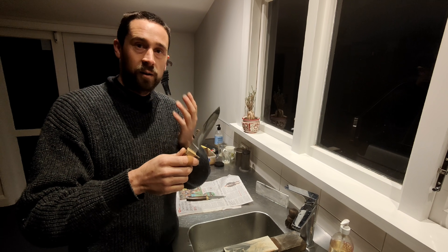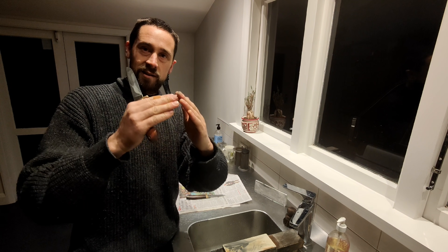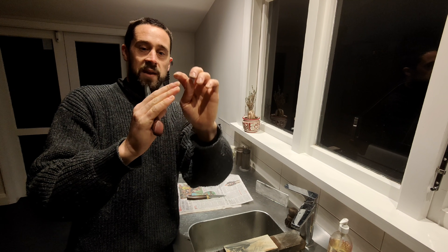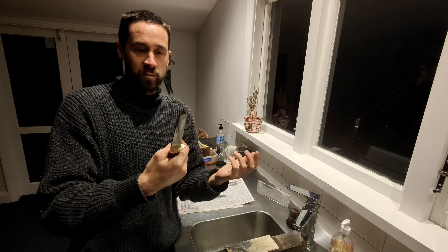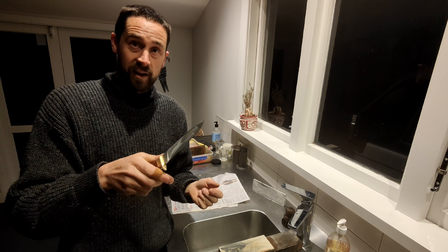If it's chipped out, you know you need to make it steeper — almost like a bowie knife, like an axe sort of thing. When you do that, the meat behind the edge protects the edge, but the edge itself is still a perfect edge. The key is to work out what your steel can handle.